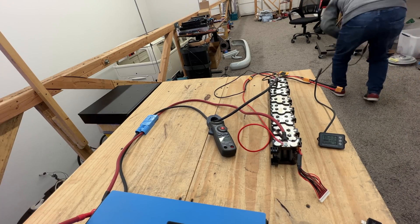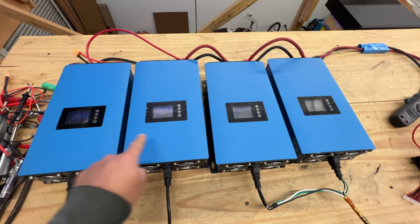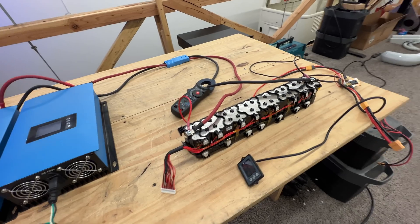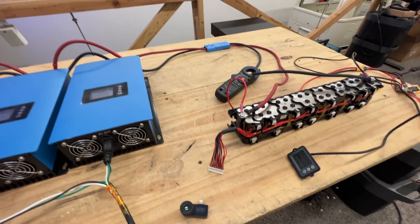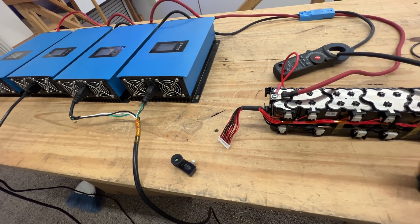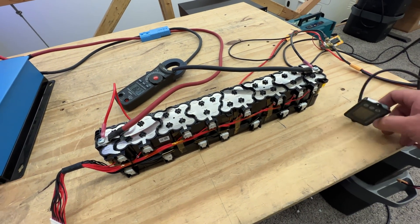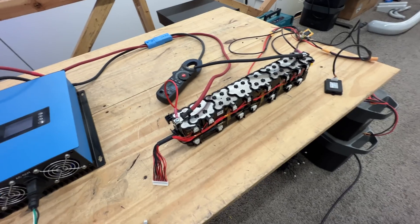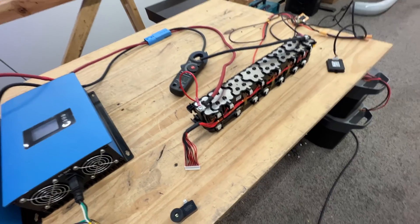Remember, we're gonna do this quick because this battery will run out of juice rather quickly. We'll get these two to do 900 also. 45 amps. We'll check the temperature because that is the best way to know what the battery is doing — if it's struggling, it'll show it. All right, 80 amps. Let's look at the voltage: 47 volts. It was at 57, so it's sagging about 10 volts at 80 amps. That is probably about the continuous that it can pull — about 80 amps.